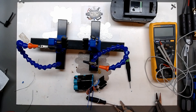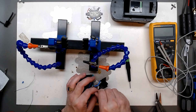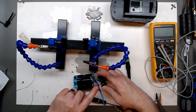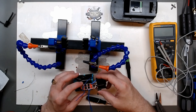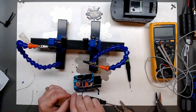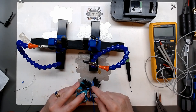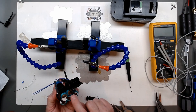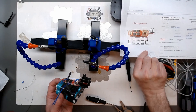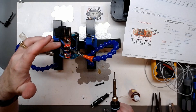Since I'm not showing the best habit here, I'm at least going to show you - I'm going to cover up these wires coming straight off the pack because I should not have stripped them already and had them exposed. They could come in contact with the board, and we are starting to put power to the board, so it does matter. If that happened it could damage the components. I'm just going to continue around following the order of this diagram for cells two, three, and four respectively.